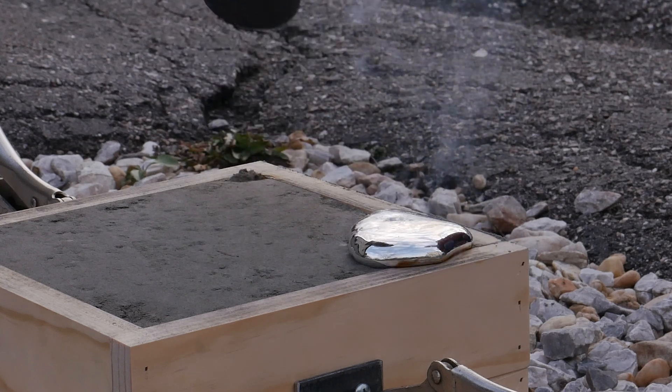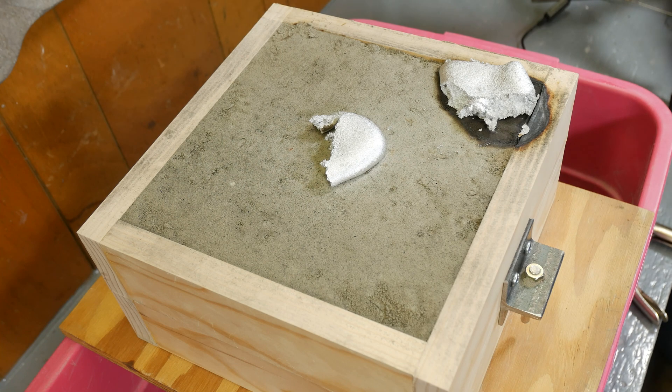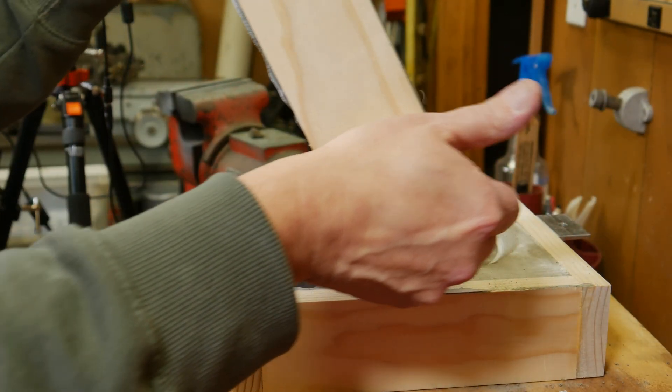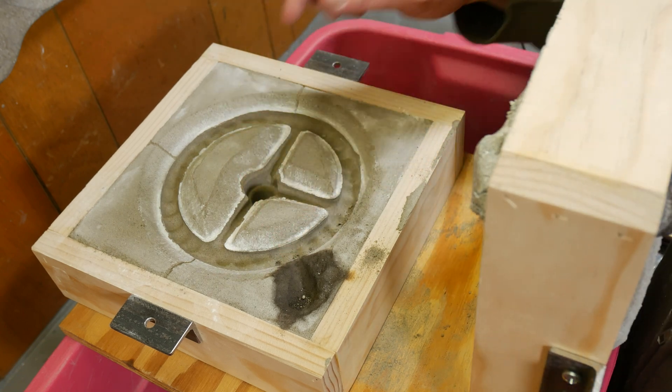That did not fill. I don't expect it filled completely — I don't think the aluminum was actually as hot as the thermostat said, and I think the gate I put in was not quite big enough. This has been sitting for about half an hour. We didn't get diddly — we got nothing. Our gate wasn't nearly big enough and the aluminum was not as hot as it needed to be, so we'll have to try again.